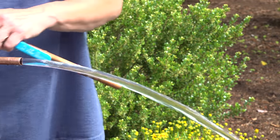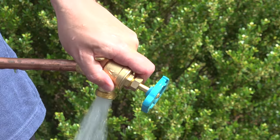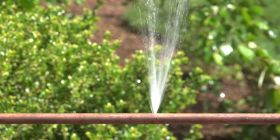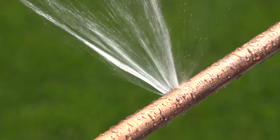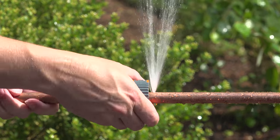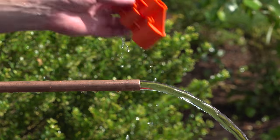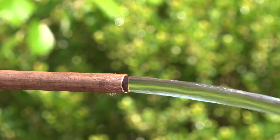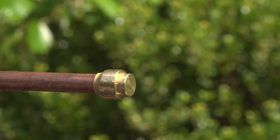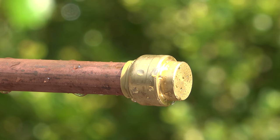Because SharkBite has been selling these for years, they've got just about every kind of fitting you could want — including a standard garden valve you can put right on the end of the pipe with no soldering. For everybody's worst situation — a burst pipe — you can do a quick repair with a SharkBite. Cut the pipe, deburr it even while under pressure, grab one of SharkBite's end caps, get a good firm hold, and jam it on the end of the pipe. In just a second you've completely stopped the flow of water and now you've got time to decide whether to call a plumber or do the repair yourself.